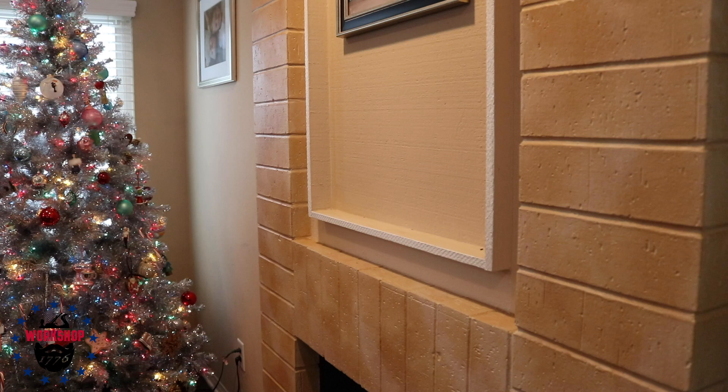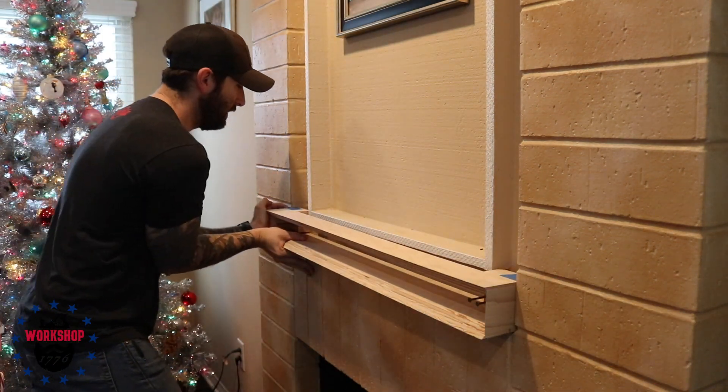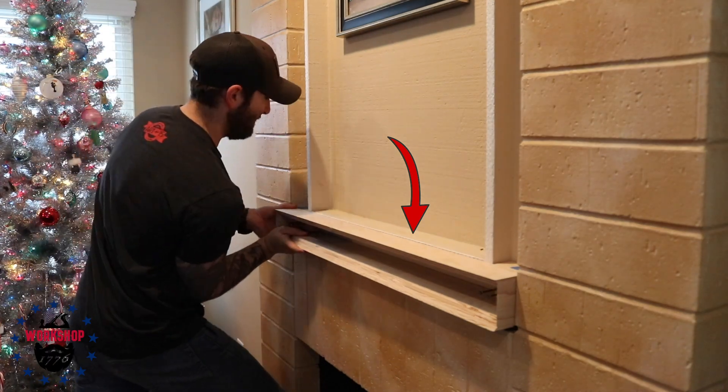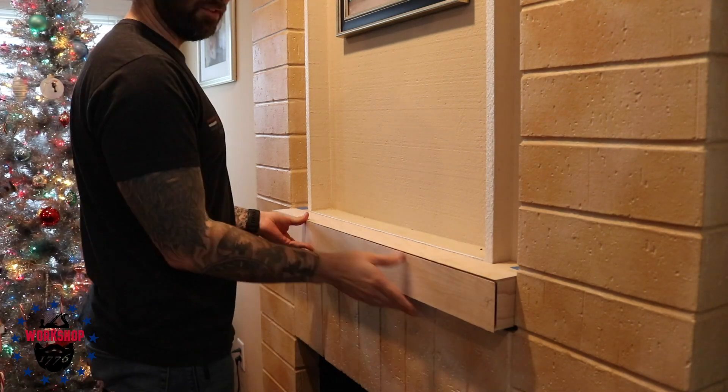So there is the frame I was talking about. You can see how the bricks make like an H shape — a letter H — and then there's a three or four inch gap on all the sides, and then there's that white frame thing with butt joints that is part of their house. The whole point was you can see how the bottom edge of the frame is completely in line with the top edge of a couple of these bricks. So the plan was to make the mantle fit just underneath the width of the bricks with a little bit of a gap on the bottom, and now you can see that the shelf the frame creates will basically be the back half of the mantle. I cut out the notch and it's going to slide in there and be one shelf with the two vertical sections of the frame coming out of it.